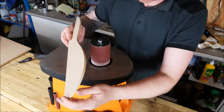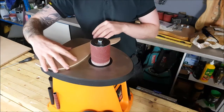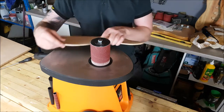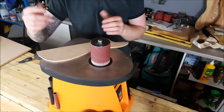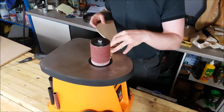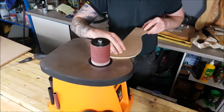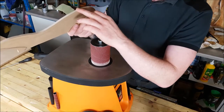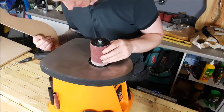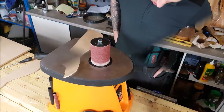So that's actually pretty good. We've got a nice finish on this. With a little bit of practice — you've got to keep this thing moving, obviously this is a drum so it's circular, so you can't put curves into whatever you're sanding. You've got to keep it moving with a consistent flow around the drum so that stops you biting into it too much. But yeah, I've got a pretty nice edge on that and there's no dust — success, that's pretty good.